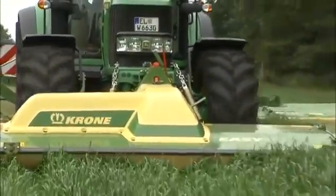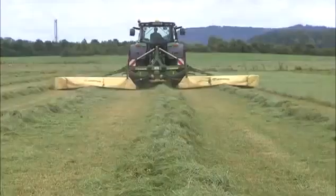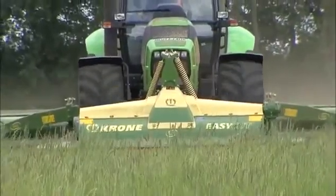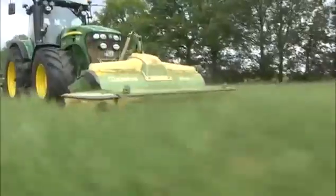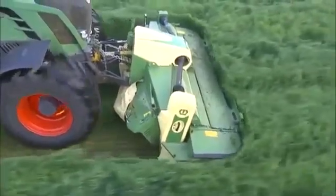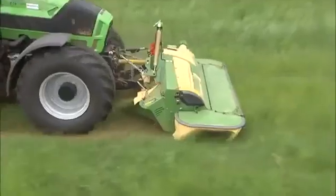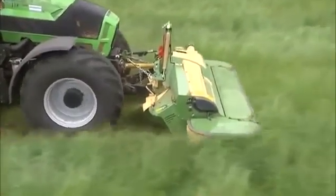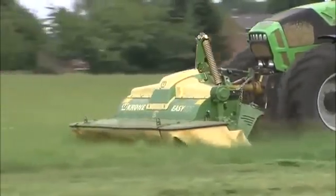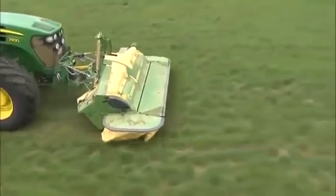The pivoting headstock, the close attachment to the tractor, the short up-and-down travel of the unit, and the center of gravity suspension combine to give perfect cuts. The Krone front mowers with steel tine CV conditioners are the specialist for producing high quality forage. The large 25-inch diameter CV rotor handles even the longest crops. The compact EasyCut F320CV front mower fulfills every need of modern farming. The ground pressure on the entry level model is adjusted by a threaded rod to tighten or loosen the suspension springs, with a hydraulic option also available for maximum operator convenience.